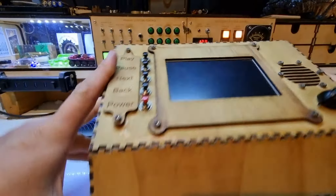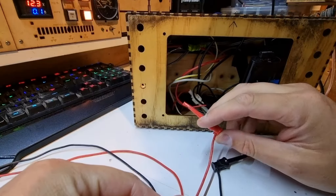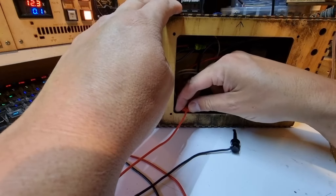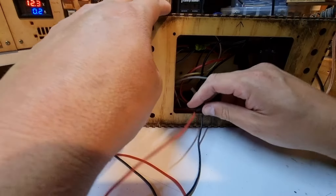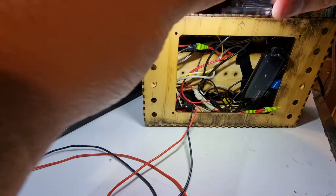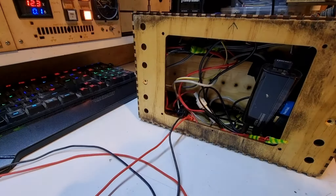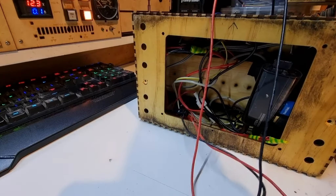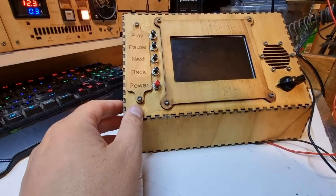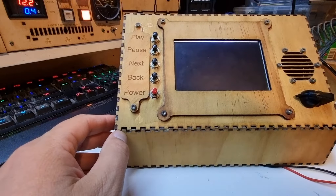The camera angles are going to be a little funny because when I made this I was working in a different form factor. I'm reaching into the back of the socket — I didn't design this to be serviceable, back in a time when I was using everything I could from a pile of junk. I've got the two clips on the back of the plug — positive is on the center pin — so let's plug this into a temporary source. That sounds good, I heard a pop from the audio which generally means we should have some picture soon. This is the volume control here; let's see if we have sound.